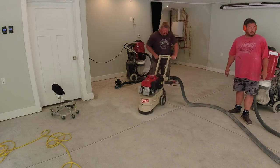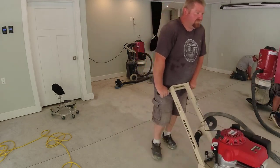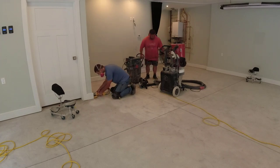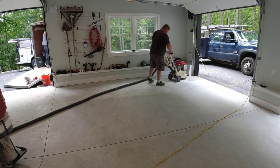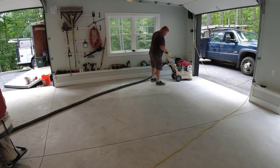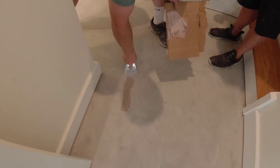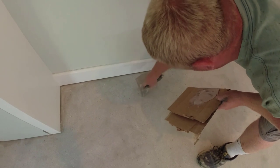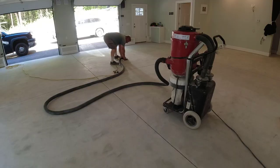This concrete was in pretty good shape — about a 1,200 square foot garage floor with a laundry room and a set of stairs leading up to the house. What we couldn't tell when we first showed up was that this garage floor had a very thin clear film of concrete sealer on it. That sealer came off pretty hard, so we rented a 10-inch grinder and that took it off pretty easily. We always grind our concrete before doing any type of epoxy coating — that's rule number one, you've got to grind and prep the concrete right.